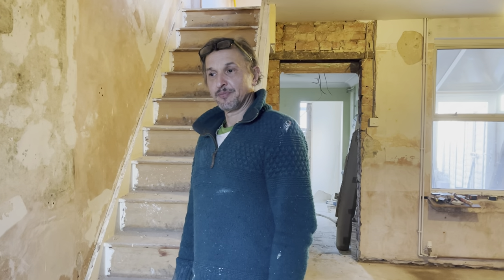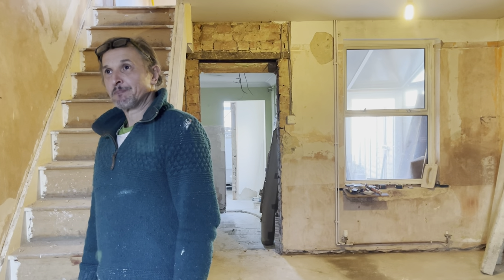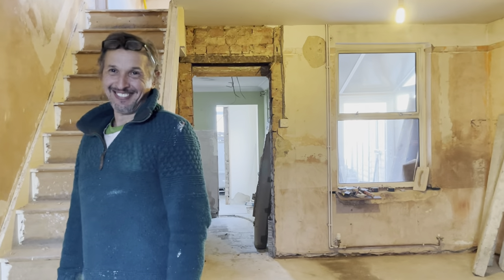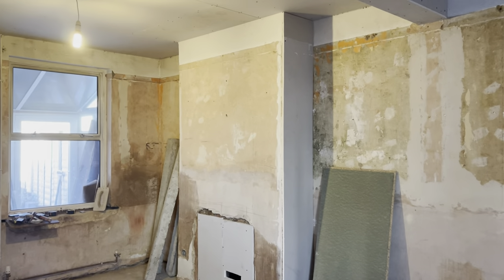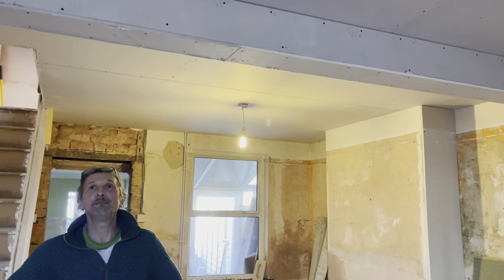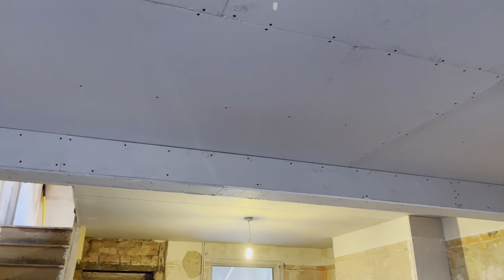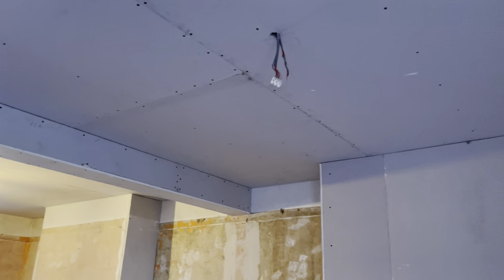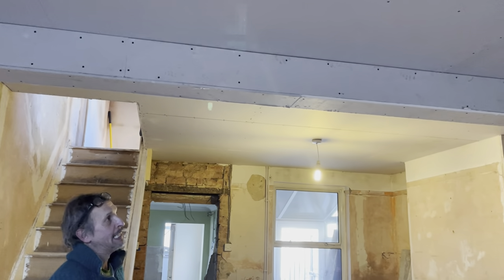His name is Mike and he's renovating here. Mike, tell us what have you done so far? We've completely renovated the property. On the ceiling, we've flattened it by placing ceiling boards up onto a subframe sitting on the joists, due to the fact the joists had bowed to such an extent there was a three-inch difference from one side to the other — so now we have a flat ceiling.